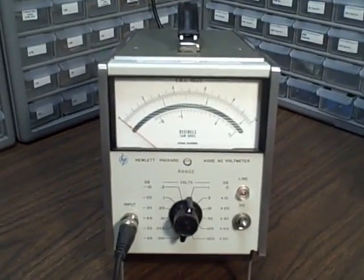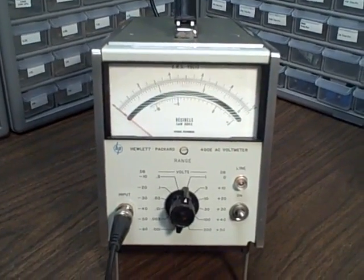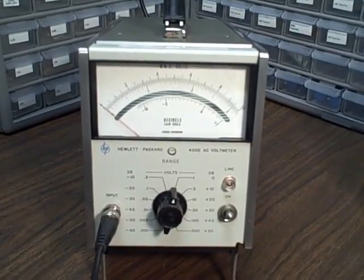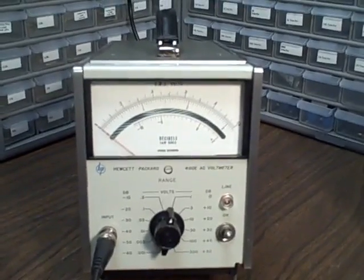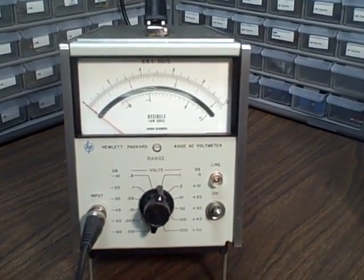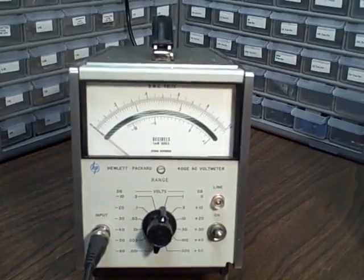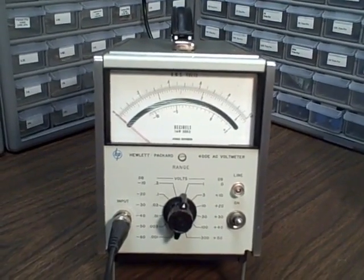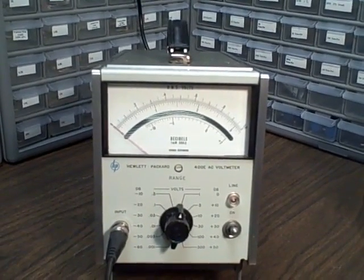It's quite useful for working on radios. It's popular with hams — it would be great for peaking your shortwave unit, or just generally making an AC reading within that 35 MHz range that you couldn't otherwise make. Most AC meters will not read anywhere near that. Most of the DVMs I see are good to maybe a MHz. A few might reach 10, but nothing much beyond that. Most of them are under a MHz.